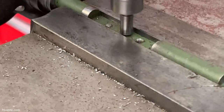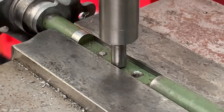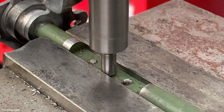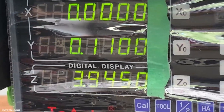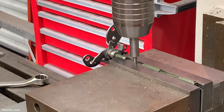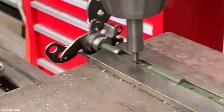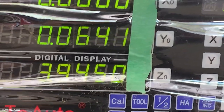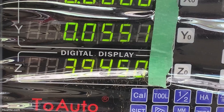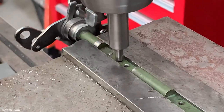It's really accurate, so that's zero. Since I'm using this just to find my center, all I need to know is what this next number is and divide it in half. I got 110 thousandths total travel just now. Since I'm touching on the outside on both sides, if I split that dimension in half and crank it back to that, that's the exact center. Half of 110 is 55, so all I have to do is go back to 55 on the readout — and that's my zero. That last digit is one-tenth of a thousandth of an inch, so that sucker is perfectly centered.